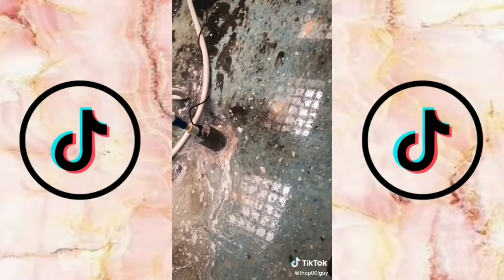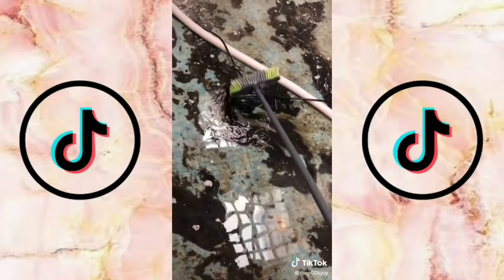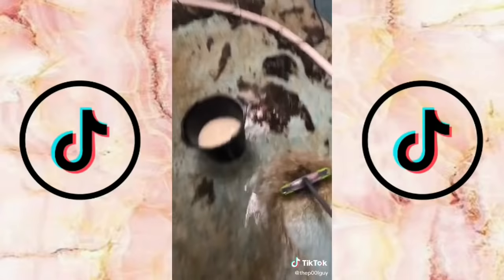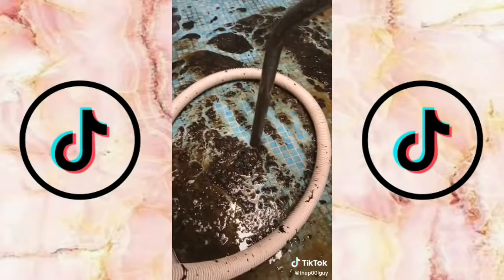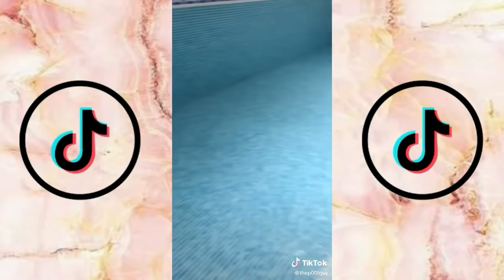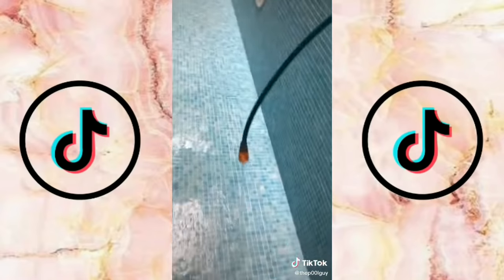Jet the steps and skimmer — pump is still pumping out. Brush the floor; it's a flat bottom so brush it all towards the pump. Get the last bit and that's job done. Stick a hose in and fill it up — that'll take a couple of days.